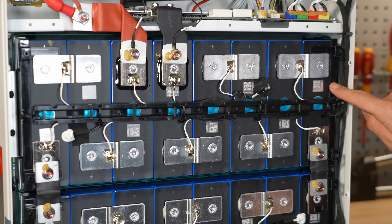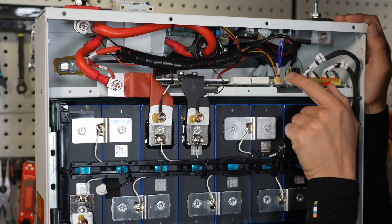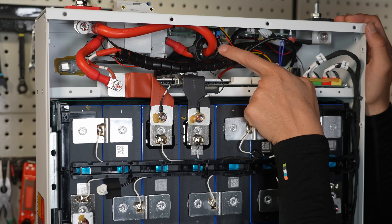And then this piece of plastic right here and then two zip ties - I don't like that. Now usually you have a power resistor as a shunt, but this one has a hall effect sensor. If this is calibrated correctly these are perfectly fine, but you never see them on these server rack batteries.